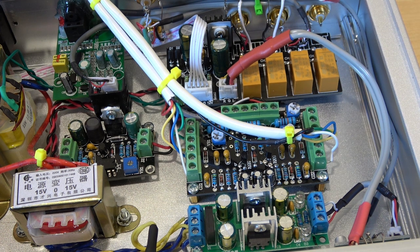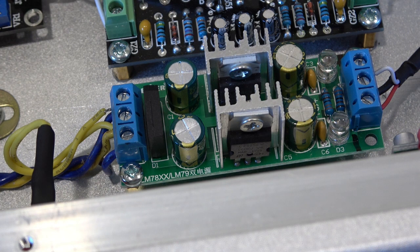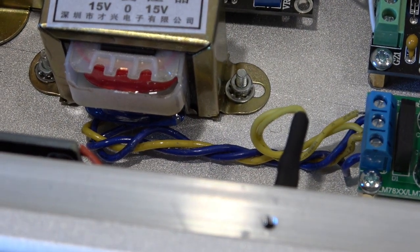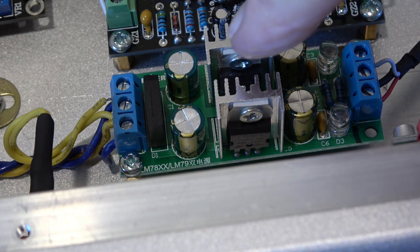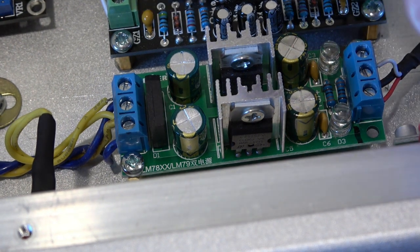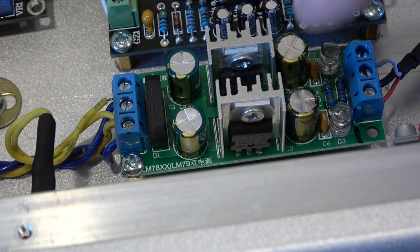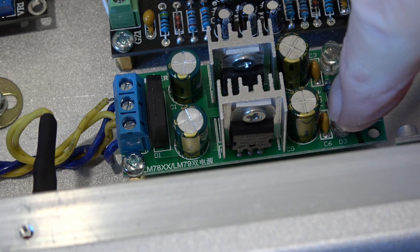Something else I've added is this little board here, which is purely to provide the plus and minus 15 volts that the new preamp board requires. It gets its supply from this small 15-0-15 transformer. The preamp itself uses a very low current, so this rectifier/regulator board doesn't even get warm. It's there because I need DC and semi-stabilized supply — so there's the obligatory bridge rectifier, a bit of smoothing, regulators for the plus and minus rails, a little more smoothing, the magic LEDs, and small capacitors in parallel with the main regulators.